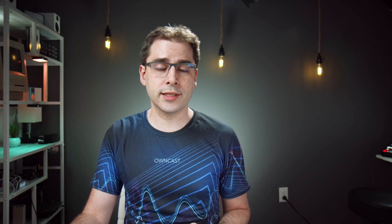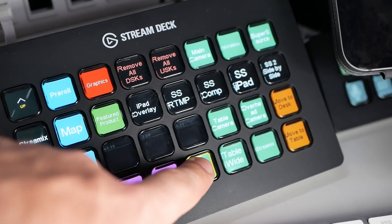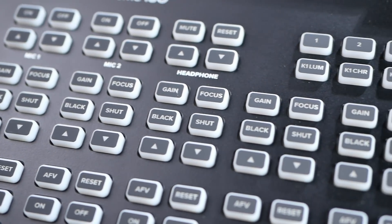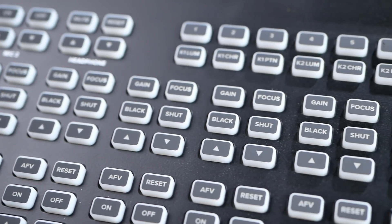Most of the time I'm actually controlling the device over the network using Stream Deck and Companion, because that lets me do a lot more things there aren't buttons for — whether that's running macros, loading specific graphics into the media players, or doing carefully timed things like switching cameras and audio sources in sync. There's a limit to what you can do with the buttons, even though there are so many of them. Some buttons I've literally never touched, like the camera control buttons — I just don't have a reason to control cameras remotely.